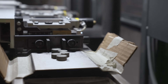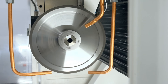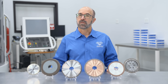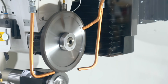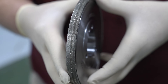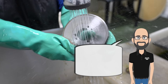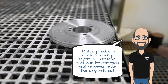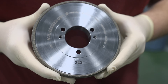Vitrified bonds are porous products, which significantly lowers the grinding force. This allows you to increase the grinding speed, making vitrified products ideal for high production applications. They offer moderate to high material removal rates and high tolerance form accuracy, as they can be profiled or formed in a process using rotary dressers. Plated products offer the highest material removal rates and fastest grinding speeds. They feature a single layer of abrasive that can be stripped and replated once the crystal fails. Electroplated products are best for complex geometry and low to medium production applications.